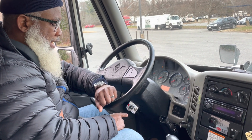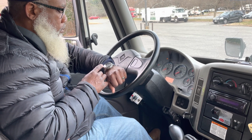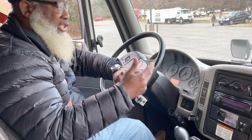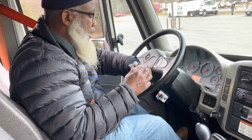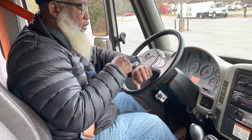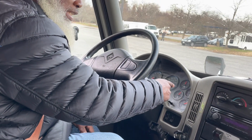Now, I'm going to hold my service brake down for my low air leakage test. I'm going to hold it down for 1 minute, and I should not lose more than 3 PSI, starting now. So I'm paying attention to my time, because you don't want to go over 1 minute, 60 seconds, like 62, 63, 64. You don't want to go over, and you don't want to go under either, 57, 58, 59. So let's say a minute is up. Right now I'm at 30 seconds. For the sake of time, you know you have to hold it down for 1 minute. So now I'm going to move my foot, and I did not lose more than 3 PSI.